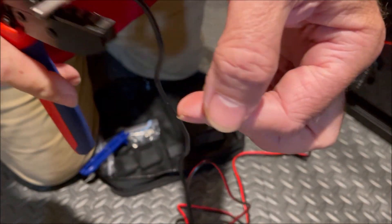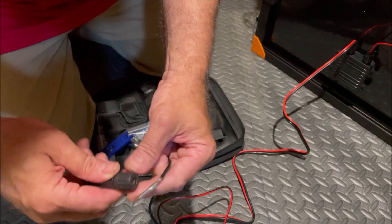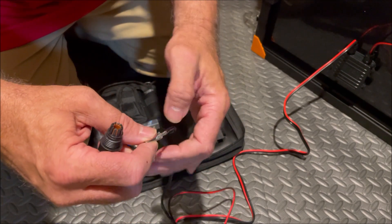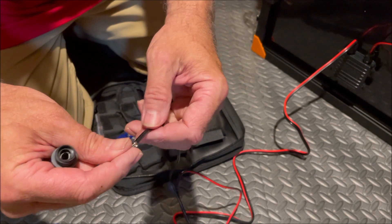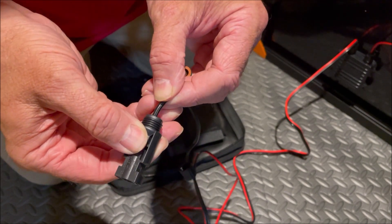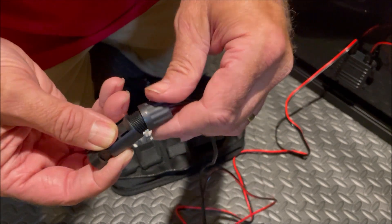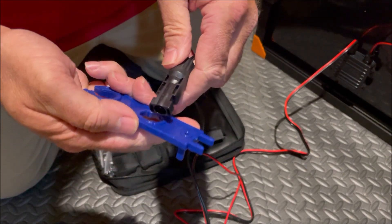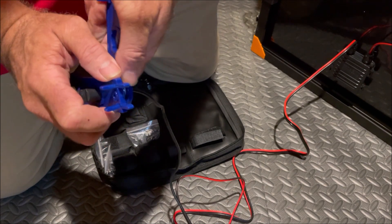It always kind of gets stuck, so just take the pin and pop it out. Remove the screw cap, put it over the pin, then remove the rubber part — remember, the rubber goes inside the connector. Put that over the pin, then slip the male pin into the female connector and listen for that click. We heard the click, it's in there tight. Put the rubber portion in, bring up the cap, and tighten it to hand tight. Use the wrenches — center slot over the front, ribbed slot over the back — and tighten until we hear a couple of clicks.